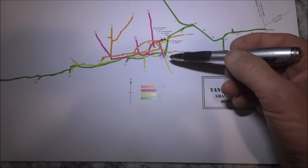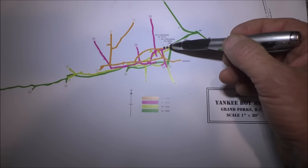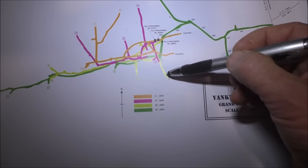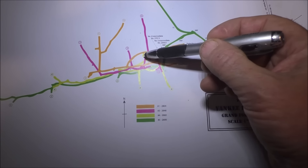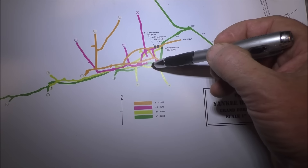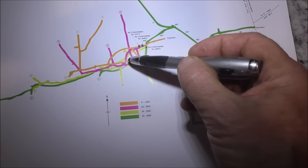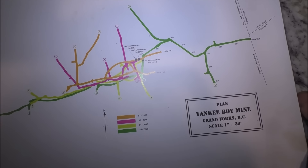Just to refresh your memory, this is a mine plan here. The 2650 level is this yellow line here. This is where the shaft is right there that we built the man way to the top. You come in here and this is where that collapse is. This just goes this far and ends there, so we can use this for a backfill. We've never been in or seen any of this — this is a new level we've never seen before. We know from here it goes up to the 2700 level above it. So that's why we're excavating all this to see what's in here.